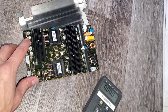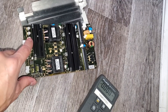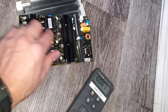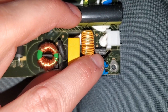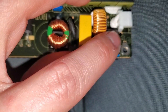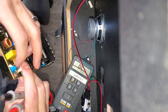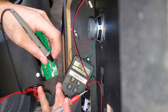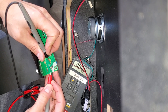If you ever do work on these boards and it's been like five years or so, you could check these capacitors and see if they're blown or swollen, or just replace them — they tend to go bad between five to fifteen years. Now, if you're going to check the fuse, the fuse is right here and this is a four amp fuse. Check that by putting your lead on one end and the other on the opposite — and that is a good connection.